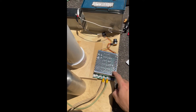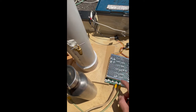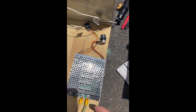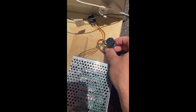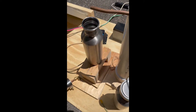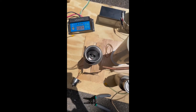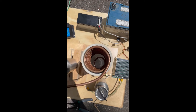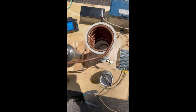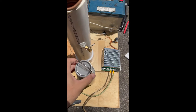The reason for the motor controller is it hooks up to the battery and lets me change how much current flows into the heating element. With this potentiometer I can dial it back to full power or like 50 percent. Once the water is boiling I can dial it back. When the water boils into steam it'll go into this distiller that I made, down this pipe, and then into this bottle as fresh water.